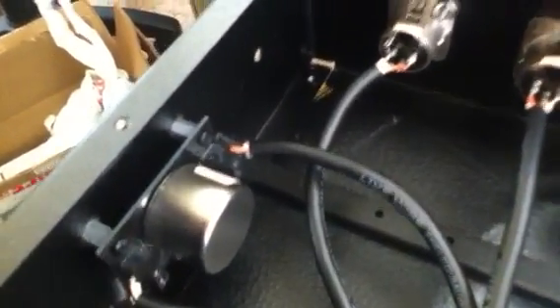Same thing with the input — grounded in. Pin one again is grounded to the XLR into the chassis, so you have one complete ground connection. The input transformer also needs to be grounded — I scraped the powder coat off there as well. This is grounded into the chassis, giving you a complete ground for the input transformer.